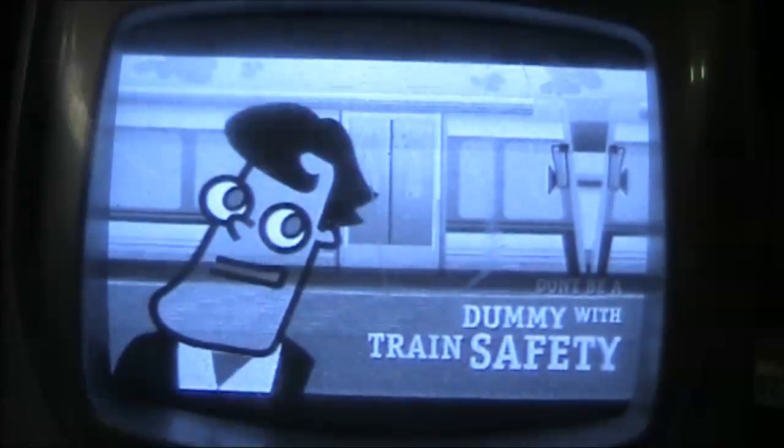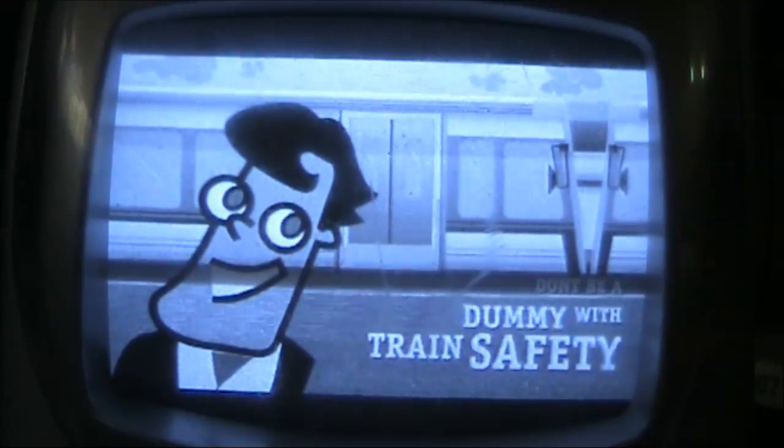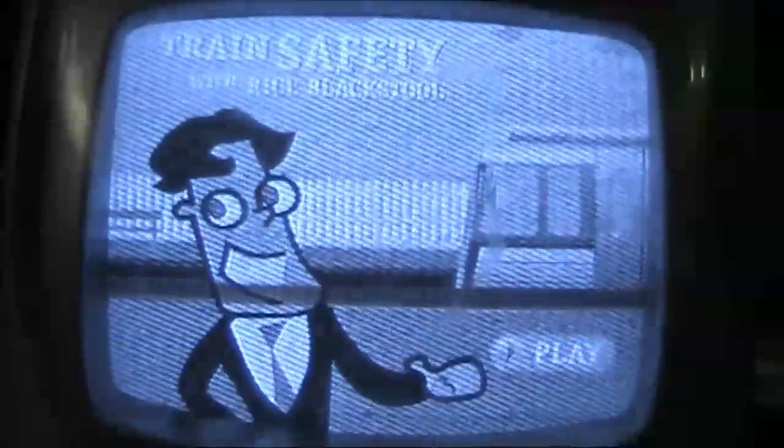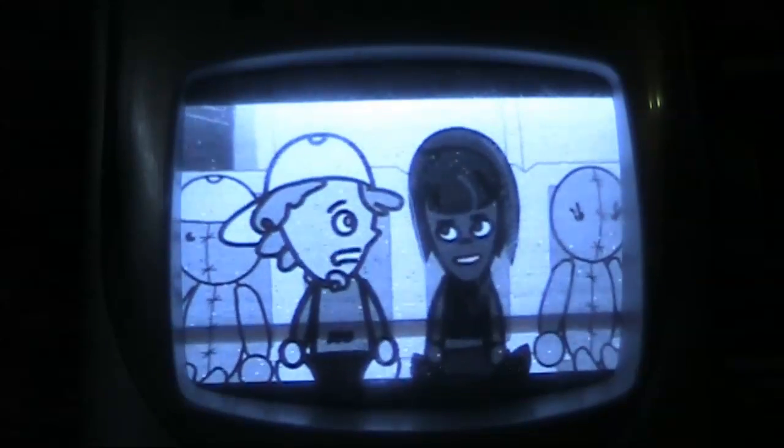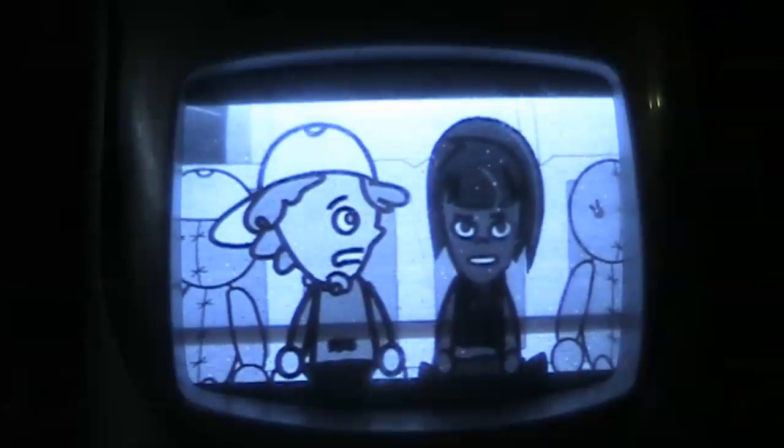Tune up further, and there's a strong signal, but a terrible picture. But if we adjust the potentiometer, we actually get a very good picture. So there's a bit of interaction between the harmonic that you choose to watch and the settings of the potentiometer. We'll keep tuning up. Again, adjusting the potentiometer. Here, it actually goes from positive to negative. I wouldn't call it broadcast quality, but it is very good quality for what is a makeshift transmitter with just 5 components.